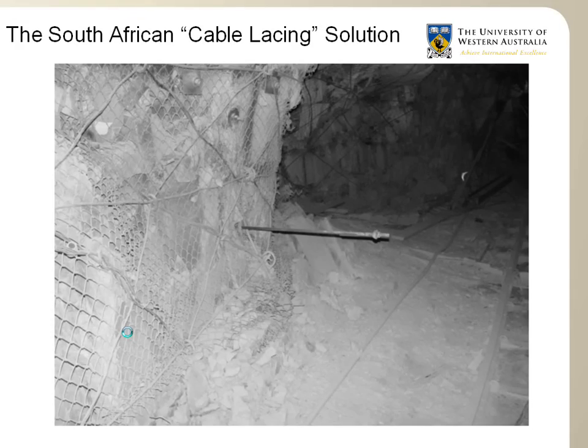In South African mines, if they expect rock burst or squeezing ground, they would use a technique called cable lacing, and they've used this rock burst mitigation system for many years.